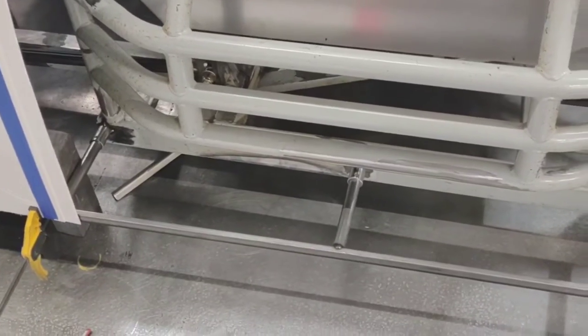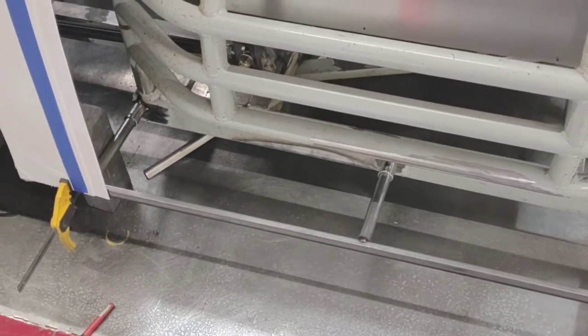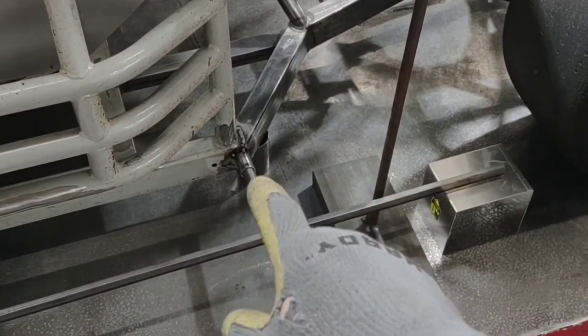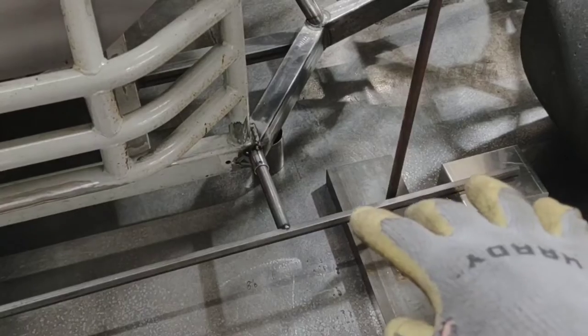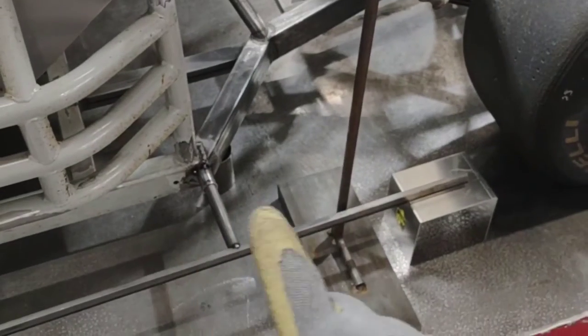Now I've got my adjuster tubes in. I'm going to check all my measurements and alignment to verify it's correct before I weld — always double check everything before you burn it in. I am also going to add a support rod as a gusset from the front strut forward because that's a large span with a large possibility for damage that could tuck that in.